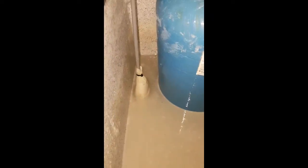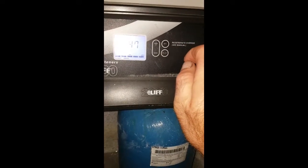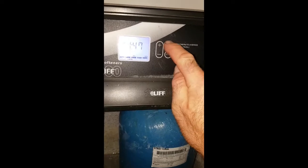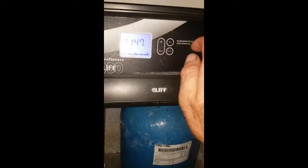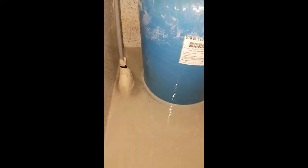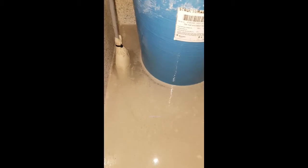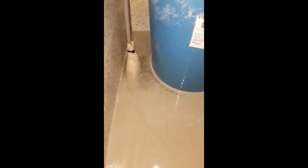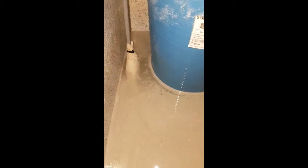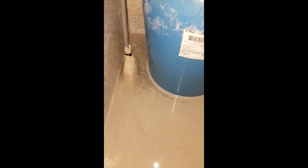I'm going to press the regenerate button. As you can see, I've filled up the tank with water and that caustic soda — bit of an experiment. Regenerate. It's now fired up, so hopefully it'll suck anything up. It's sucking stuff up. I'm going to regenerate it probably about four or five times, keep filling it up with a little bit of caustic soda and then wash it through with water, so hopefully that pressure will come out of the shower to clear the system.